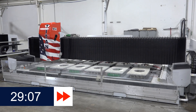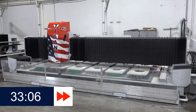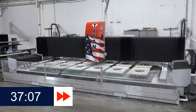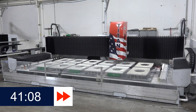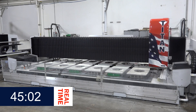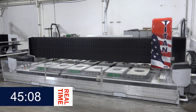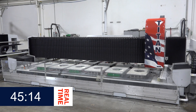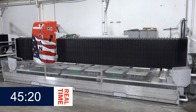So now that we've done that, we're going to come back with our very first shape tool. Position number one typically doesn't run real fast — it's going to be about 120 to 125 inches a minute. That's our first metal bond. Typically that's going to take off the most material so it's going to come in a little bit slower than the rest. Now you're going to see the high speed tools come into play. They're going to come in on positions two and three at about 600 inches a minute or better. They'll come in a little slower as they get onto the stone and then ramp up right away to high speed, and then decelerate at the end. This is going to happen quick so if you watch close you'll see those rapid movements.